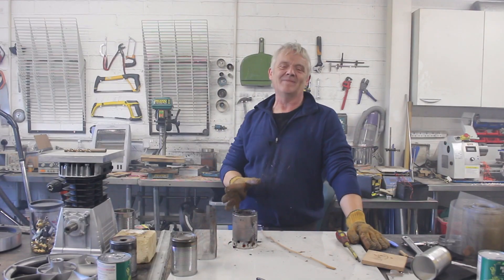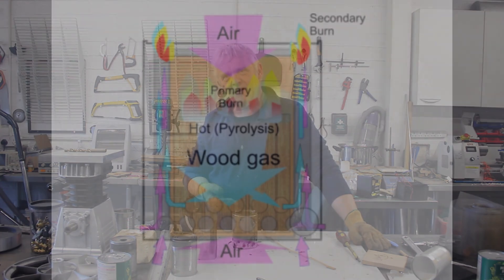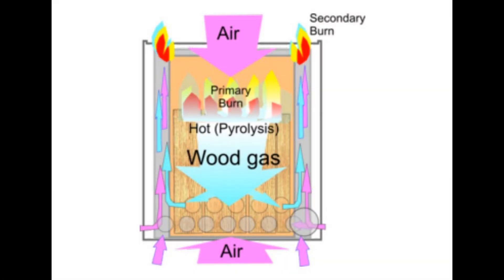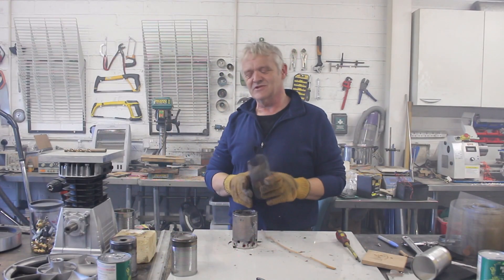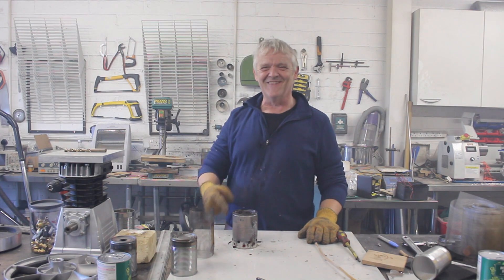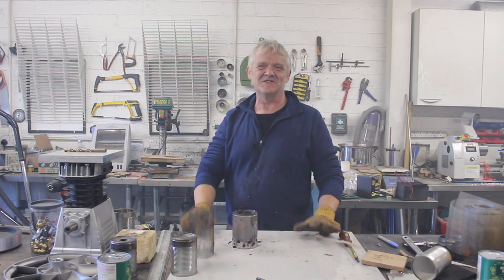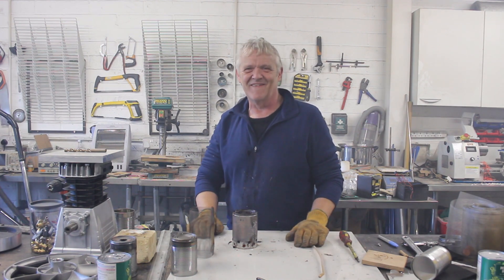For such a simple thing — two cans stood inside each other with some holes drilled in it — we effectively made a gasifier slash mini rocket stove. And you saw what that flame was like when we added the mantle. We added the mantle because that's what changes a stove into a heater, which is what we discovered in video 1701. Piece of cake to build, runs on wood, gives out some heat. I hope you enjoyed the video — thank you very much for watching, and please do remember to like and subscribe.